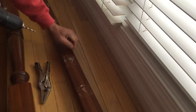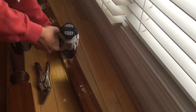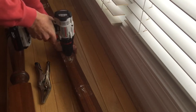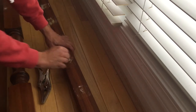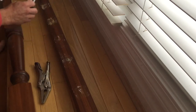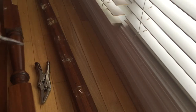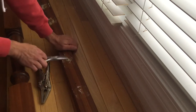You might need to do this a few times because it's not wiggly enough yet to really get in there. You're probably thinking, why are you drilling holes in the underside of the railing? It's not going to really matter because we're just going to fill these in with plastic wood filler. Once we fill that in, let it dry, sand it and paint it, you're never going to see it - plus it's on the underside, so even if there are any imperfections, it doesn't matter.